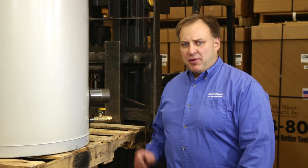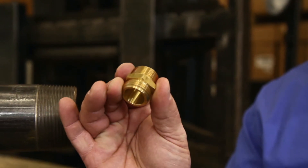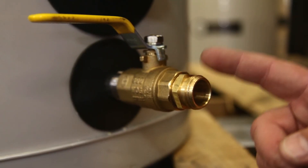Because we fitted the ball valve with both hose bib and tapered NPT threads, contractors are directly able to connect to the ball valve and fast fill the system without having to worry about making sure they've got the right connections. The right connections are all right here, ready to be installed for your convenience — which ultimately means more money saved on every install for both the consumer and contractor. Kind of amazing how one little brass part can mean so much in terms of time and energy. But that's the beauty of Boiler Buddy: it's an innovation that makes efficiency look easy.